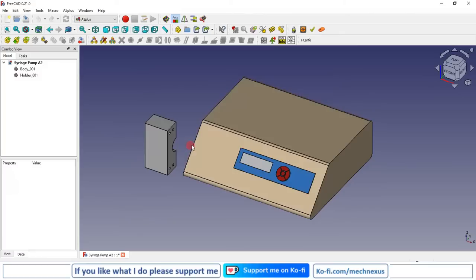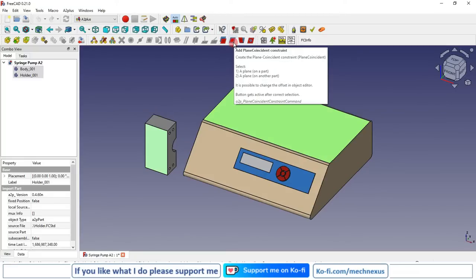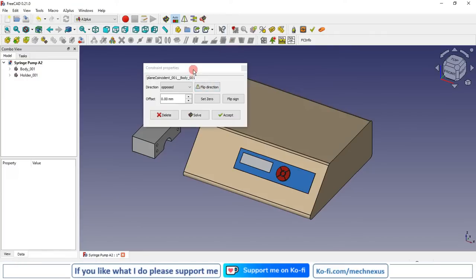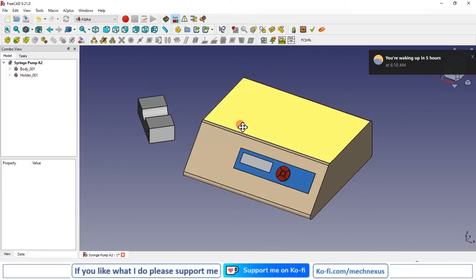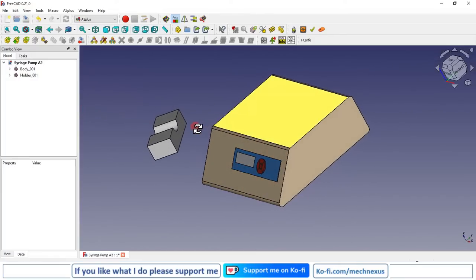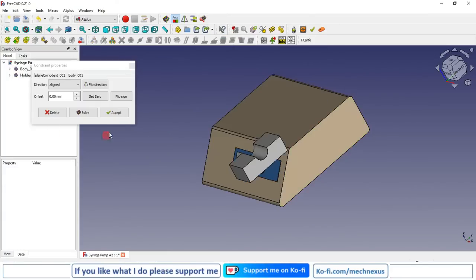Now we will give constraint between this body and holder. So press the control key, select the bottom face and the top face of the body, and once you select the two faces, FreeCAD will show you the possible constraint here. Now we will select this add plane coincident constraint. So you can see that constraint has been placed, but I want direction opposite. I will accept it. Now I will rotate my model by pressing roller and right side button of my mouse at the same time. Now I will select this face and this face, and I will place plane coincident constraint and I will accept it.